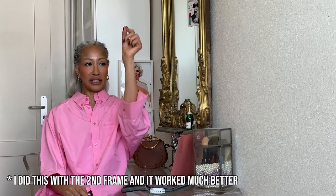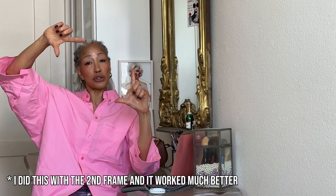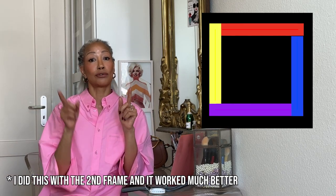Okay, please let me jump back in here. I'm making all of us dizzy with my cinematography, but what I'm trying to explain is because you're overlapping the woods at every corner, you're always going to have one piece pushing against the other. And when I first glued this corner together and then this corner, by the time I started working on the third and the fourth corner, it was a little bit unstable. I would suggest first connecting this corner, making an L, connecting this corner, making an L, and then when those are secure, then you can join the last two corners. And make sure you are joining your corners exactly in this overlay pattern, just like this.